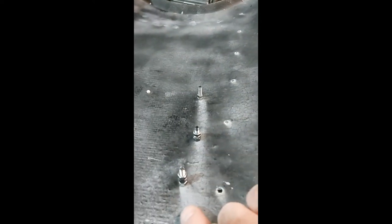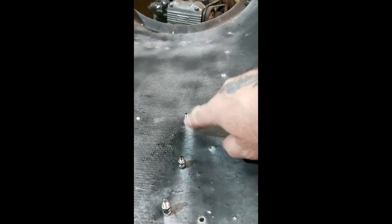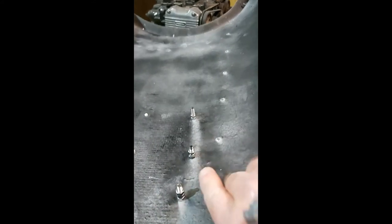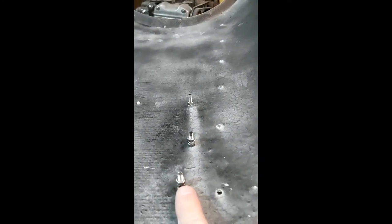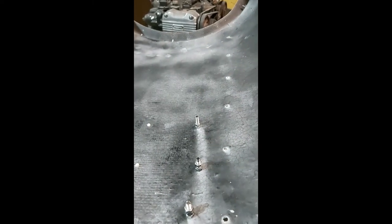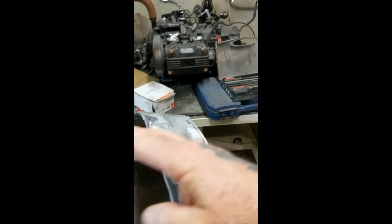Right, this is the underside of the lid. What you're looking at here, you can see the shadowed area there. That's the footprint of the hinge that goes underneath. What I've done is the hinge is spaced. As you can see, there's three nuts there. That's the spacing for the hinge. The idea is when the lid is opening and closing, it has to clear this, so it's not rubbing up and down and pulling all the paint off.